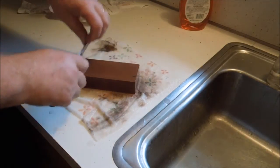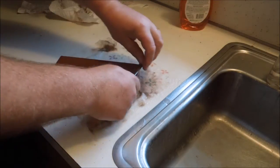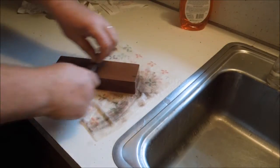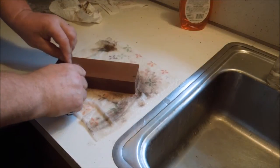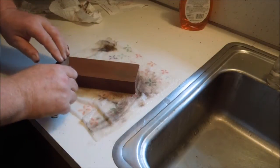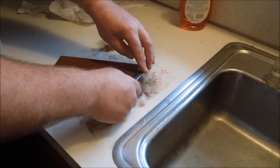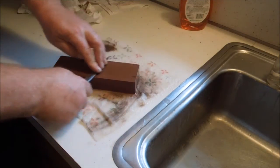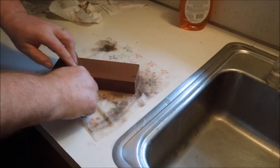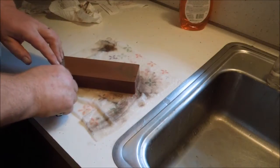On a grinding wheel, if you're cutting hard stock, you want a soft wheel. They call that friable. Friable, in other words, it fractures easily. I don't know if they say the same thing about water stones, but I know on surface grinders, when you're cutting tool steel, especially something that you don't want to overheat and take the temper out of, you want to use a soft wheel, because that'll have the sharper grits exposed more frequently, and it won't rub dull abrasive on the material and just heat it up.